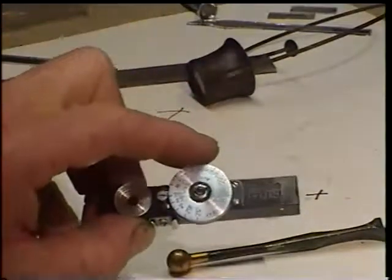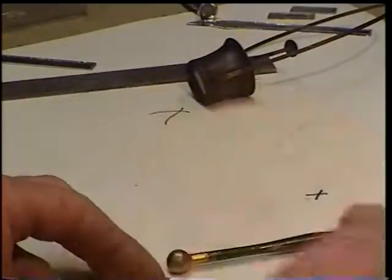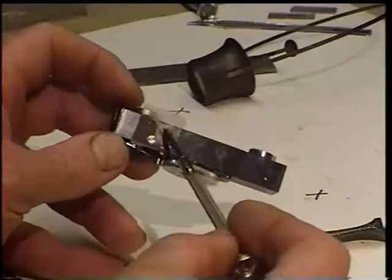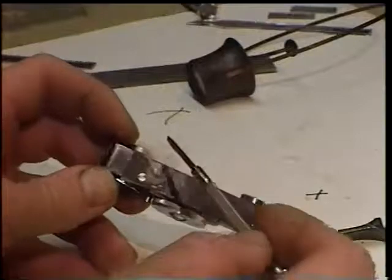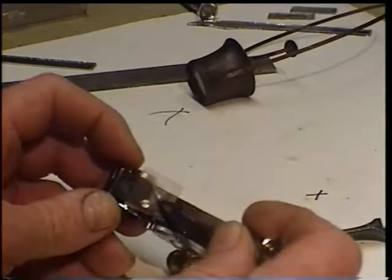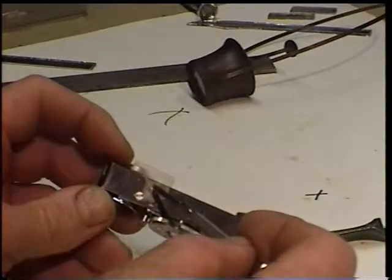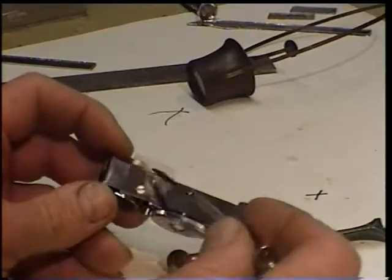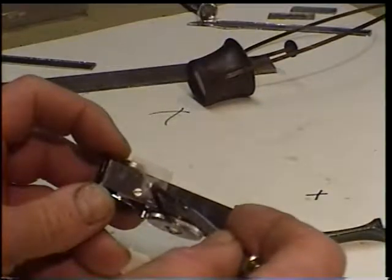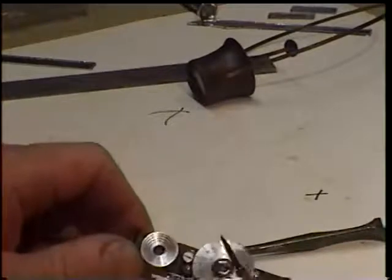The one I worked on is within a couple of feet of being correct, but it's going to take more time. After you've got your horizontal images just about dead on, there are two screws here — I've got these taped because they're a little loose. I think this one is possibly stripped or near to it, so I put tape on to hold them in place. Loosen these screws slightly and they will give you a little bit of diagonal motion across the top of the rangefinder. You have to play with this. If you loosen both slightly, you can move that mirror around a little and try to get those images to come together at the right distance that the dial indicates.